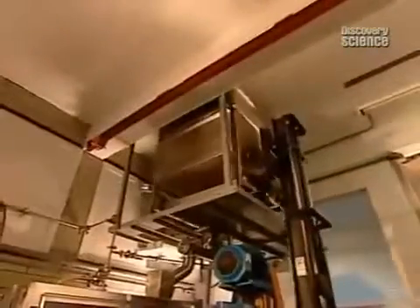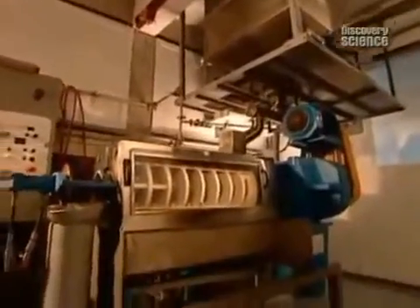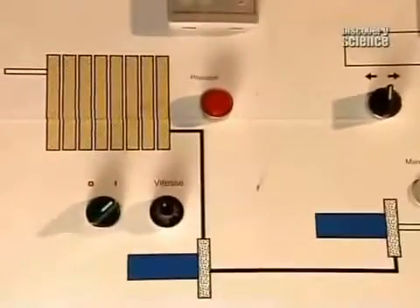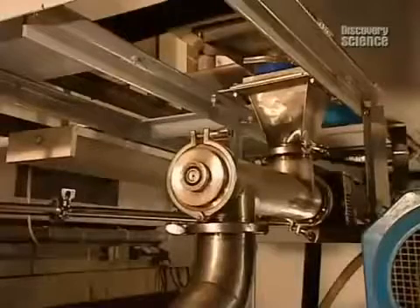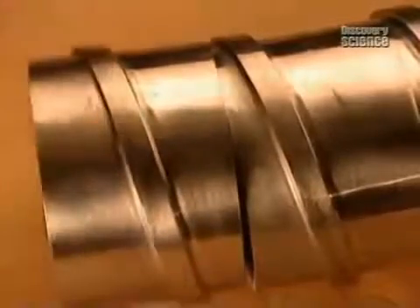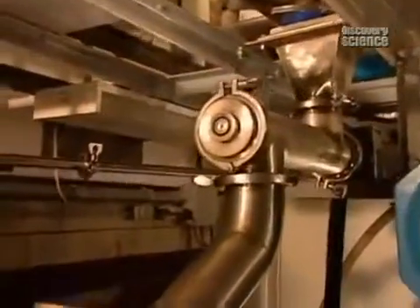These seeds, shells and all, will go through this low-pressure press. The temperature inside is kept below 40 degrees Celsius — hence the term cold pressed. The press operator has to carefully monitor and adjust the speed, pressure and temperature. Keeping a press cool is no easy task, given the heat that mashing seeds naturally generates. The pressing mechanism, the screw press, is made up of several sections, so they can shorten or lengthen it according to the type of seeds they're pressing.